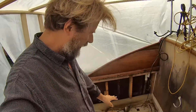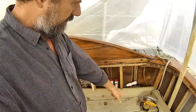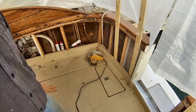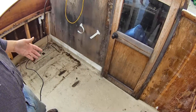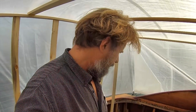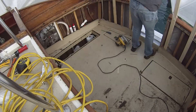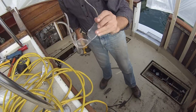Okay, no more stalling — propane is removed. What I'm going to do is open up the hatches, remove the hatch covers, and basically cut between the holes where the hatches are, so the bulk of the center of the floor will come out. I might have to cut it into small enough pieces to carry. One long cut along that side, and as soon as I cut up the floor it'll get soft and wobbly. It's actually sitting on the water tanks from what I can see through the hatches. Nothing to be said but get on with it — safety first.